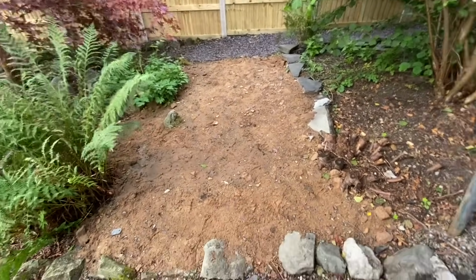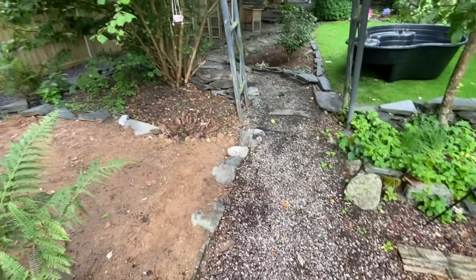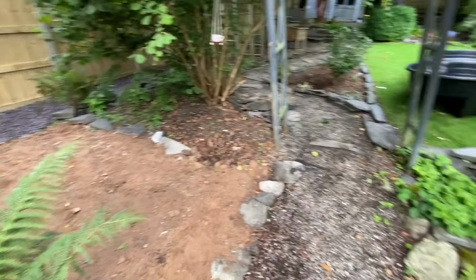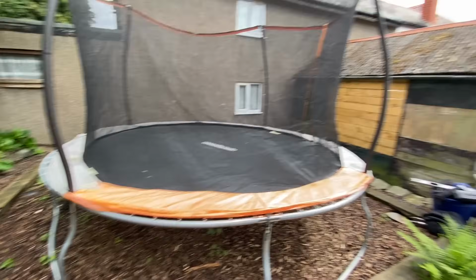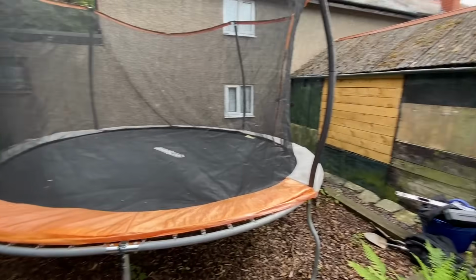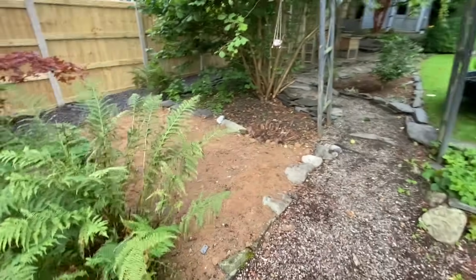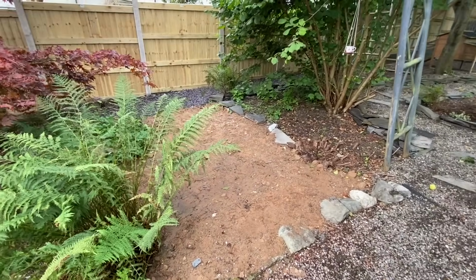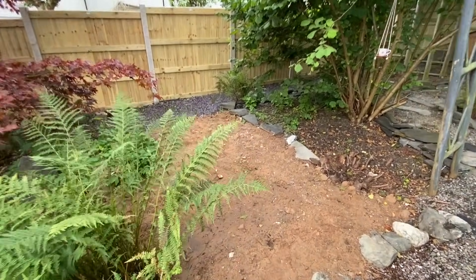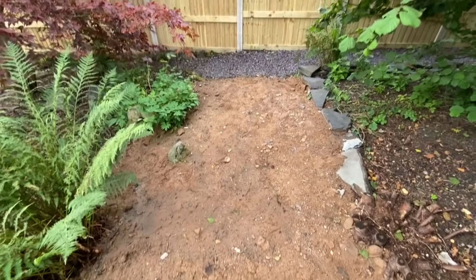So it's right next to the path here where the customer comes up the garden, and it's also ideally suited where we can get the electrics from the shed. So there's already electrics there, and we'll come off the shed, run it along this building, go underneath the path, and then we will have a switch box, probably a Blagdon switch box, over here for the pond and all the features on the pond. That's why we've gone for this area.